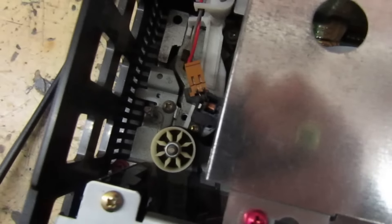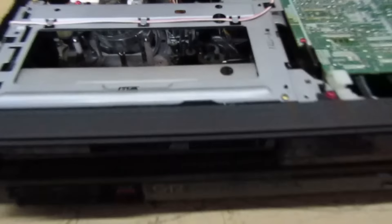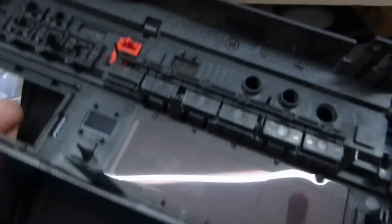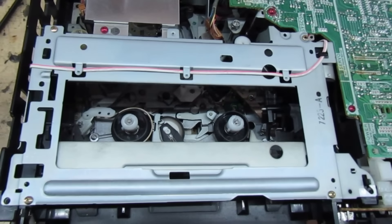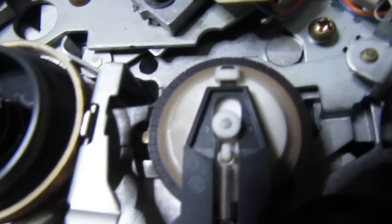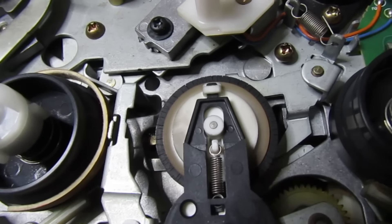Hi guys and girls on YouTube, welcome to my channel. In this video we're going to be looking at this vintage Panasonic NVG12B video recorder. Now despite having a G in its model number, this is one of the last ones that didn't use the awful G deck. The G deck had problems - you couldn't just rebuild it, you had to put all brand new cogs in, otherwise a few weeks later the cog would jump and you'd be back to square one. Luckily, this isn't a G deck, and it's in remarkable cosmetic condition.